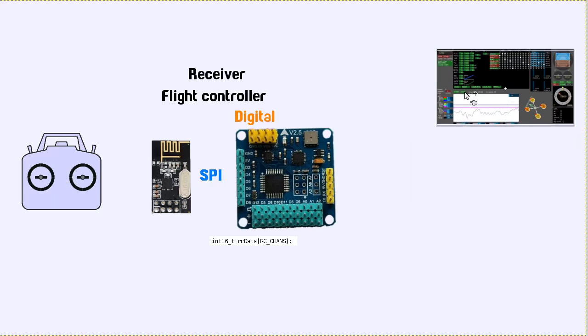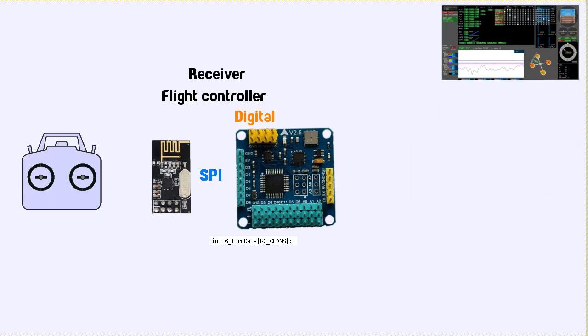And specifically what I've been using this for so far is the information that gets sent to the flight controller: throttle, yaw, pitch and roll, a couple of dials that I'm not actually using, and then we can use a byte for some kind of switch data. So you can actually fit 8 bits of information into 1 byte like this. Because it's digital, you're going to get exactly the same information you sent coming out at the receiving end.